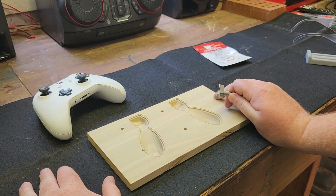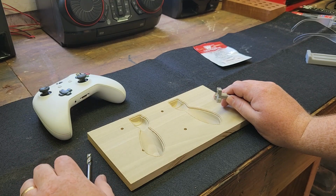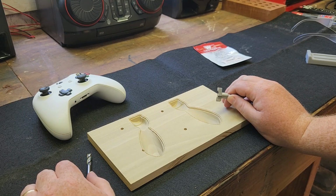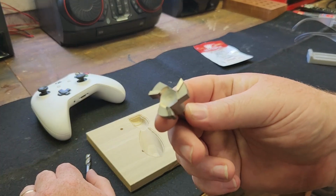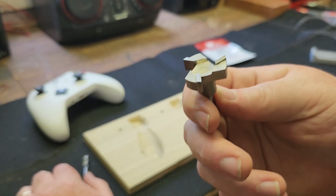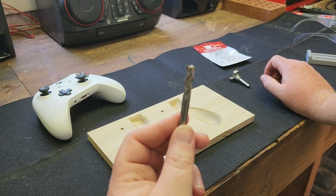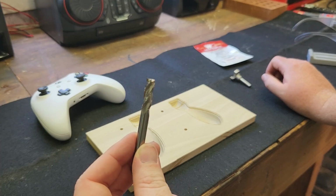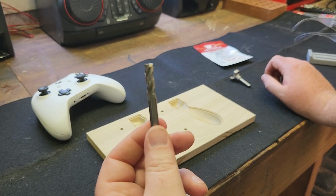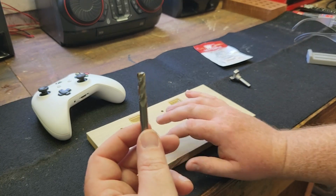Alright, that was fun. It was nice to knock the cobwebs off. These are the first chips in the new shop, so I was really looking forward to this one. This little fellow worked as advertised. All you gotta do is spin it and it'll make stuff flat. Unlike this. Granted, I don't recommend roughing with dull downcut end mills. It'll kick up a really nasty burr, but a little spring pass knocked it right out.